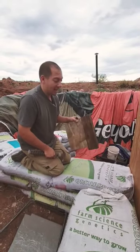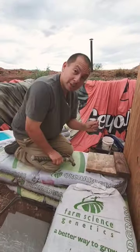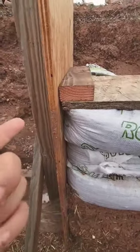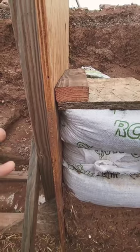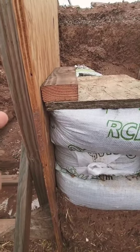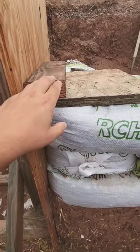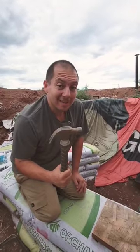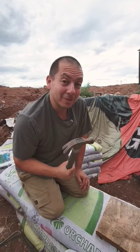Now that I've got my board assembled, I'm going to put it in place. I'm just going to use some nails so that the board grips to the bag. The reason for the cleats is because eventually we're going to install a door here. But if you want to nail anything into an earth bag wall, you want some wood to be able to attach it to, not just the dirt bags. That'll give you a nice firm grip. It's just that easy, and now we're ready for the next course.